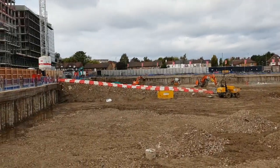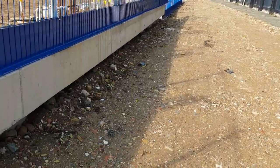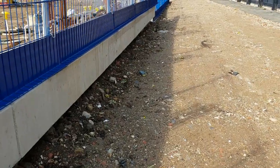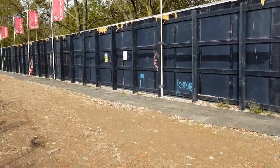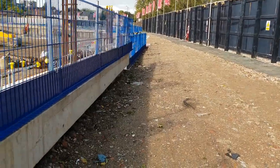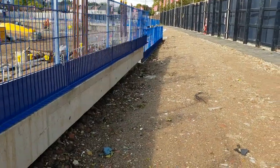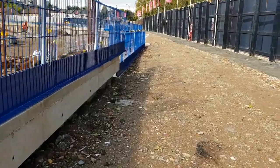As you can see, the coping is finished here. This piling mat was 14 meters wide and one meter deep, so it's quite a lot of material. After my first video showing you the targets and all the coordination, your next job is just to mark the coping beam line — that gives you the line for the piling mat. Tensar geogrid was also used in here.